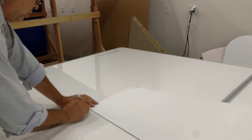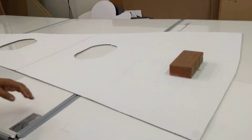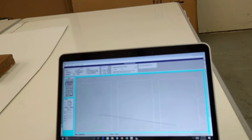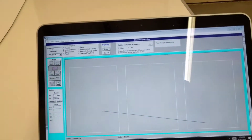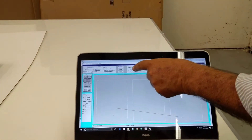I've got a line starting so I'm going to do that point right there and I'm going to come over here and digitize this corner right here, and then on the computer screen it'll show me that line that showed up. Now I'm going to tell the software that I'm going to switch to arcs. I'm going to click right up here at the top arc.